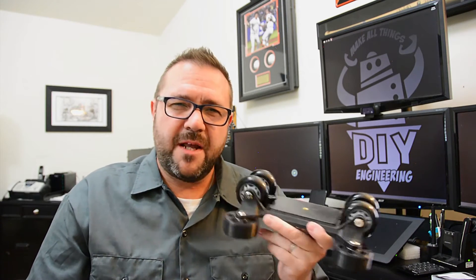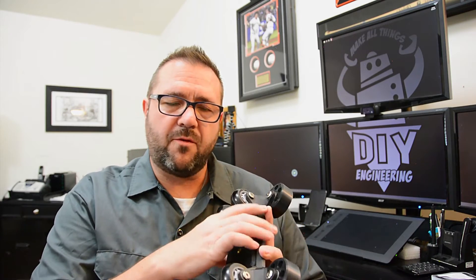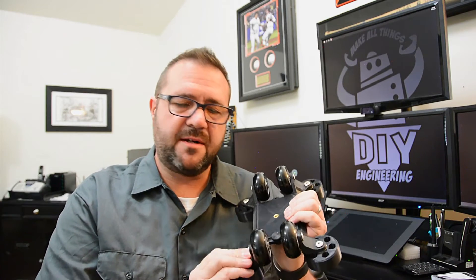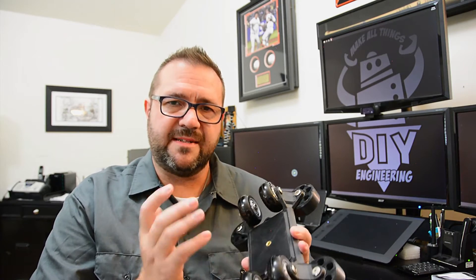When selecting the material, it boils down to those six filaments. It's pretty easy to understand what the determining factors are. If you've designed the part to be strong and sliced it with the right type of infill or the right number of shells, that can increase your options. If you have a strong designed part with dense infill using an alternating pattern that makes it very rigid, you're not so reliant on the filament itself as much as on how it was sliced and designed.